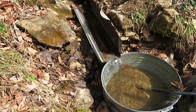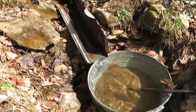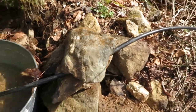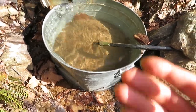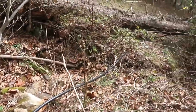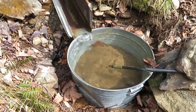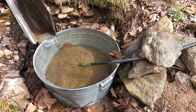If you're trying to do something simple like this on your property, it's pretty self-explanatory. You just get yourself something to carry the water from above grade down to your tub. I weighted down this water line with some rocks and angled the lead line a couple inches underneath the surface so it gets the clean water and not the sediment at the bottom. There's a simple little filter that keeps leaves, rocks, and salamanders from getting into the water line. This water line is running gravity-fed downhill. If you've got a spring below where you need the water, you can do a hydraulic ram pump or pump it up if you have electricity.